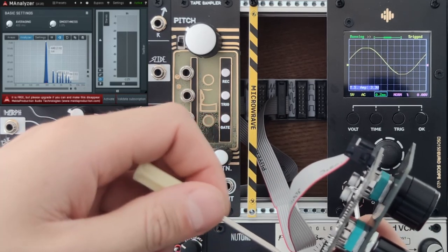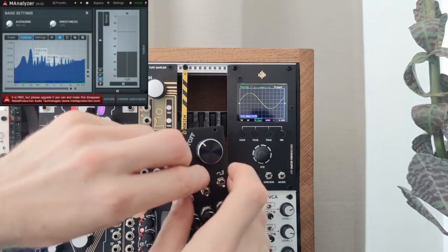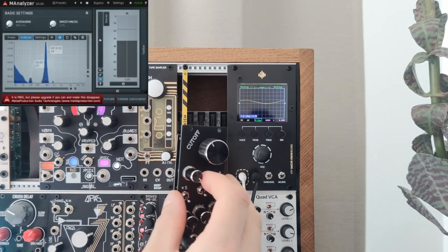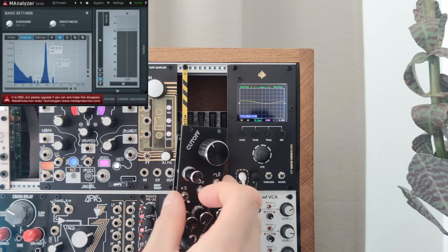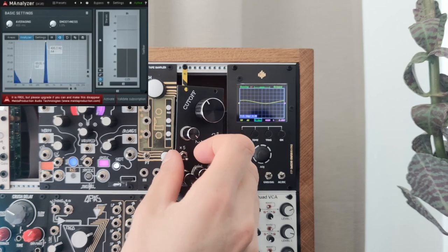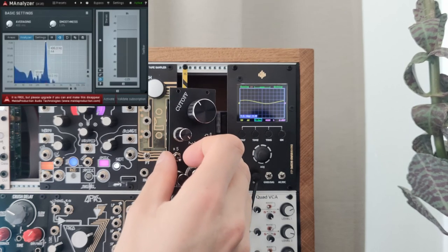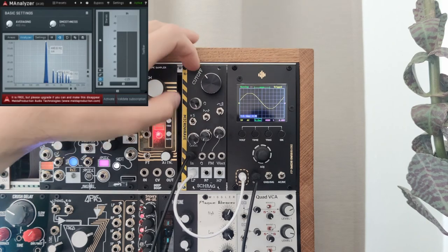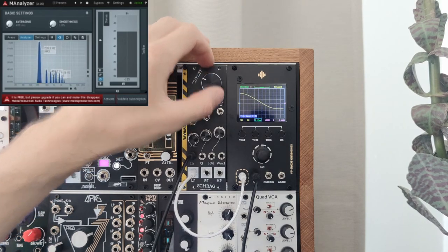Dial down the resonance a little and open up gain all the way. Then make sure the filter can be pinged by merely sending a gate signal to the input. Next up, switch the resonance to sawtooth mode. The manual says to also flip the 5-time boost switch.